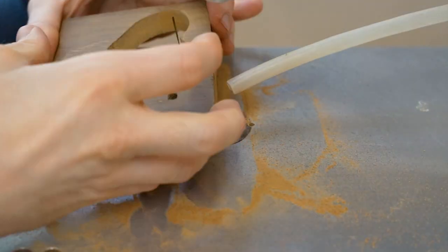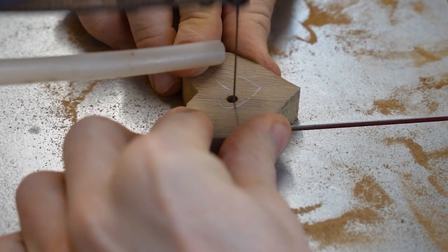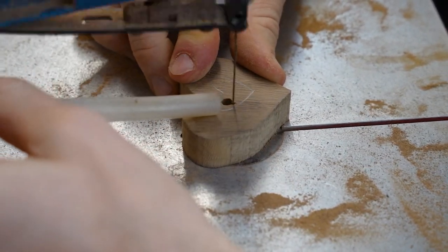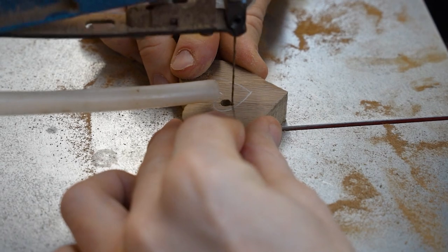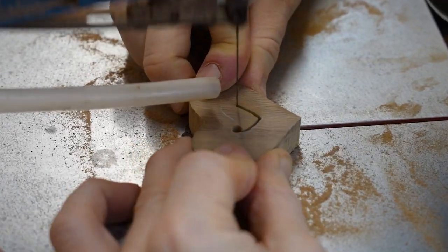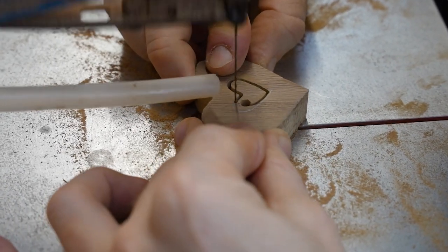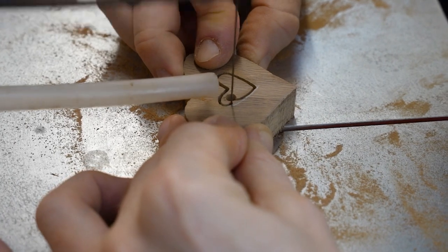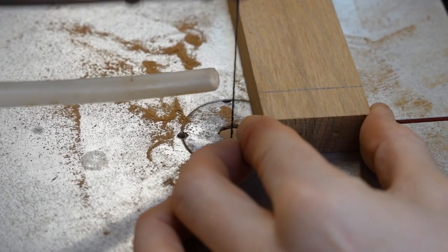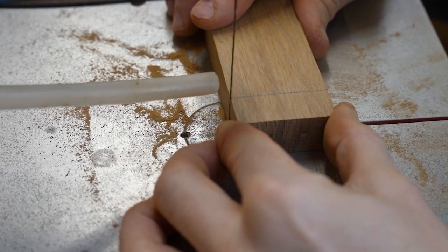When it comes to the advantages, you can cut in different directions, as opposed to the other two blades, where you can only cut in that single direction, meaning that you have to continually rotate the wooden item to be able to follow the line. With the spiral blade, you don't have to do this. The blade can cut forwards, backwards, side to side, and everywhere in between.